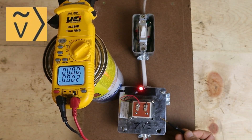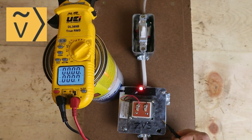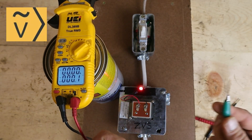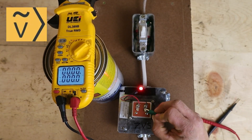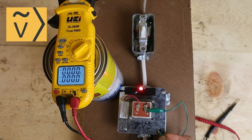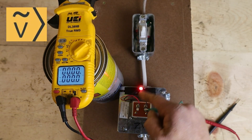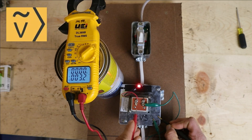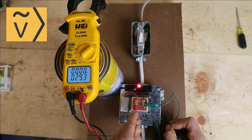The reason why I'm not reading 29 volts when I go to the metal box is because this metal box is not actually part of this circuit. Now if I were to take alligator clips, put one on the common terminal of the transformer and the other on the metal box itself, my metal box is now part of that circuit. If I try my reading again — one probe to the metal box, the other to the load — you can see I am now reading my 29 volts.